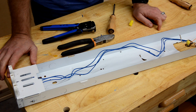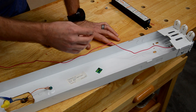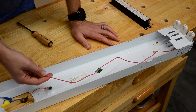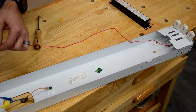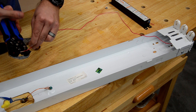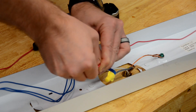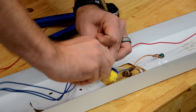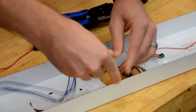Now let's switch camera angles and do the other end. You'll notice something different on this end — we only have one wire. Each tombstone is daisy-chained, so this one wire is actually supplying electricity to all three connectors. So what we'll do is cut it, strip our wire, and with just two wires the pliers aren't as important. You want to pull on these wires to make sure you've got a good solid connection.